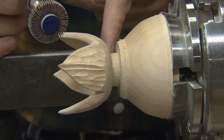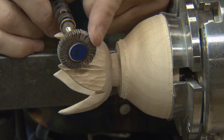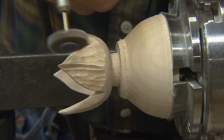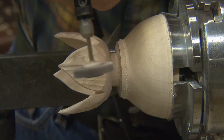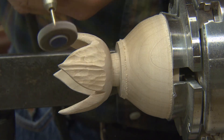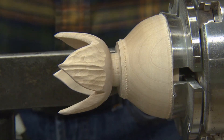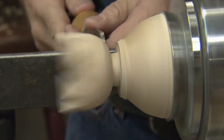I've done a little more shaping and I've almost got this ready to part off. A little sanding done here — I'm taking a little flap disc sanding disc and very carefully taking off some of the high spots on the shape and any leftover pencil marks. That will help smooth things out. Gives it a nice look instead of being so harsh. Like I said, I was just going for texture — just the illusion of the leaf. I didn't want to make this look like excellent carving, because it's just not my repertoire.